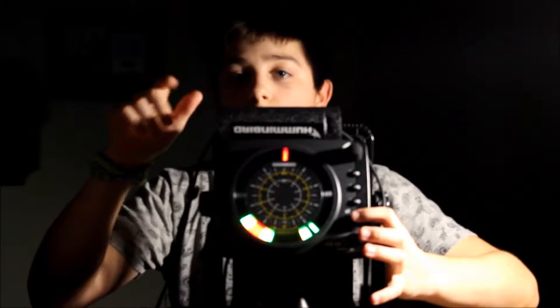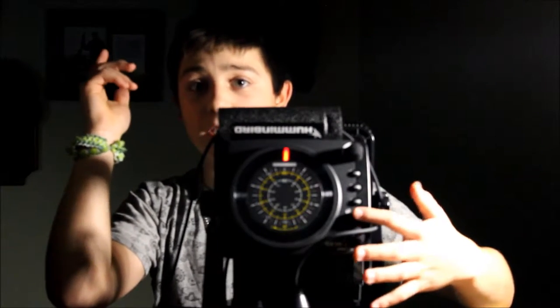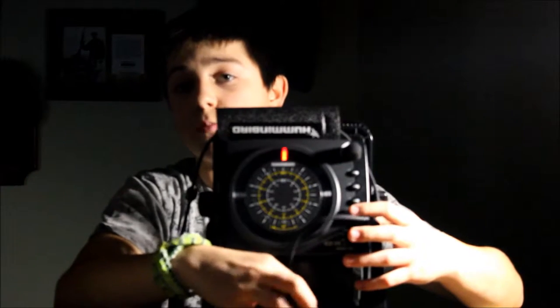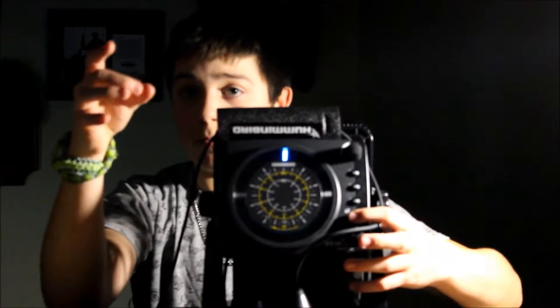Taking it off demo mode for a second — when you hit the beam button, you switch between beam settings. The transducer comes with two beams: a 19-degree wide angle and a 9-degree narrow angle. I have it on wide beam right now; clicking it switches to the smaller cone. In shallower water you use the wide angle, and in deeper water you use the smaller angle to get a clearer signal further down.